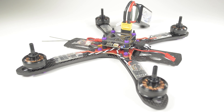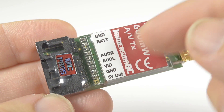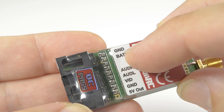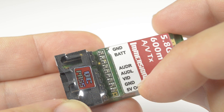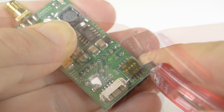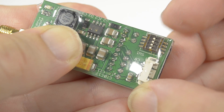Clockwise and clockwise. Before installing the VTX it will be placed face down, so just take a picture of the order of the connections — particularly that ground is on the outside and supply inside, and this is a non-standard order. Video, ground and five volts. Also cut out the switches so that you can use them, and now you can change channels.